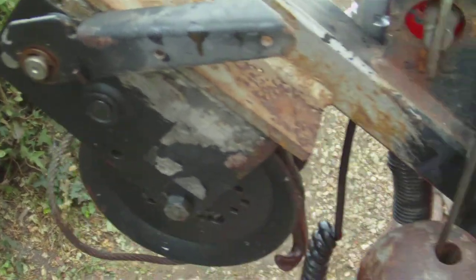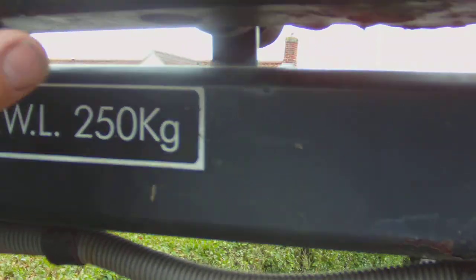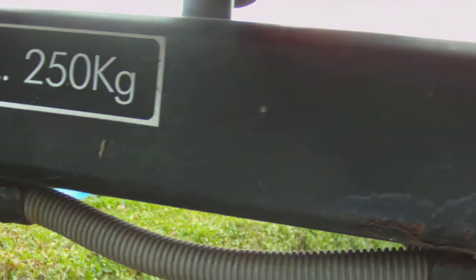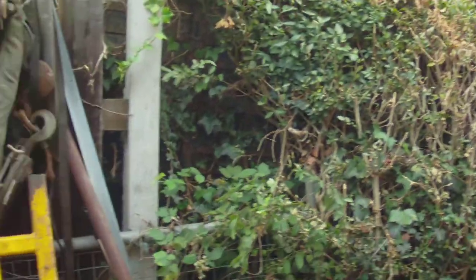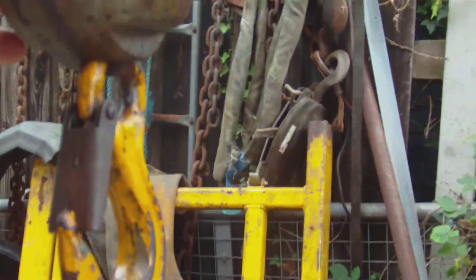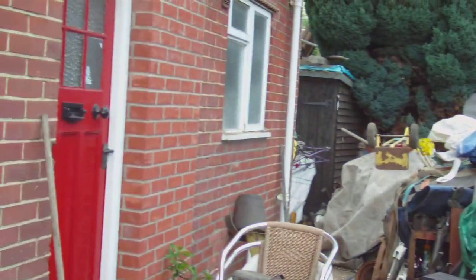I have got an additional winch on here because this used to be on a flatbed trailer so you could winch cars and plant up onto it, but now I've stuck it on this other trailer. You've got this top arm pivoting here on this boom, held closed by these little rubber grommets. You pull that out, loosen that off, and there's an anti-loose fitting in here. Take that off and you can bring your two booms round. What I like about this particular crane setup is you can get any position — over here, over there, round both sides of the main crane, just how you please.